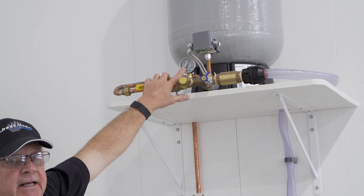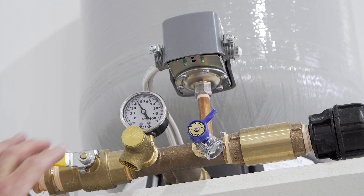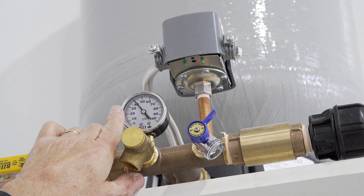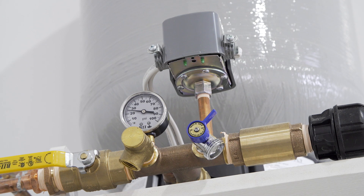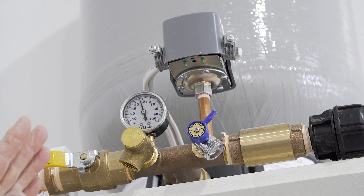To demonstrate that gauge, I'm going to turn on this bib and run some water through a hose, and you'll see the pressure drop on the gauge. This system is set to engage the pump at around 40 psi, and the pump will shut down at 60 psi. You can see the pressure falling off now, and it will begin charging the system just around 40 psi or slightly below. Now the pump — which is a one-half horsepower, 12 gallon per minute pump — is bringing the pressure back up to stasis, which will be around 60 psi or a little more.